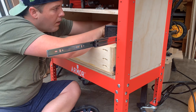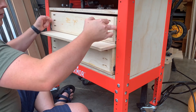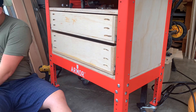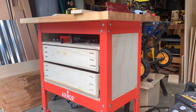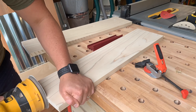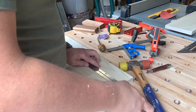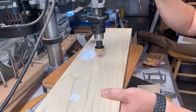To fit drawers and drawer slides flush, I need to move things out. Three-quarter inch plywood is actually 23/32nds, and combined with half-inch ply on each side, it's just enough to make it perfectly flush. I got the height for this little shelf so the plywood sits right below the dog holes and doesn't conflict. Some people skip the shelf entirely for drawers, but because of all the holes I have, I want a cover there to catch sawdust — plus it's a bonus shelf for clamps. Get your pocket holes drilled in the shelf and slide it in first.